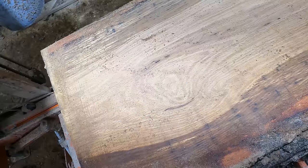Well, let's see how wide we are. Oh, I got 18 there. Where's the bark end? So here's a narrow bit. Look, 18 1/8. Perfect. So I've got the width I need. So all I've got to do now is go this way. Well, the bottom didn't have enough width. Let me see if there's any place where it doesn't. Maybe I need to take a little bit more. What am I at here? I'm at 20¼, almost 20½. So I'll take a 1-inch board off the top, and then I'll have to take another 1-inch off the other side, and we'll have more than enough width.